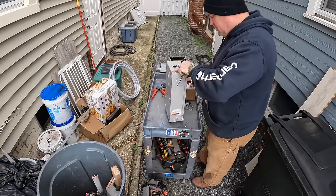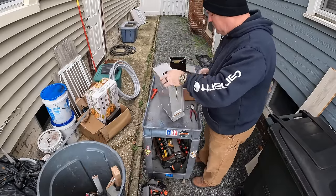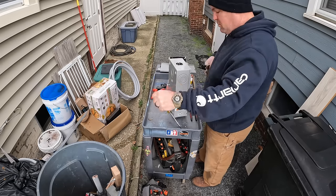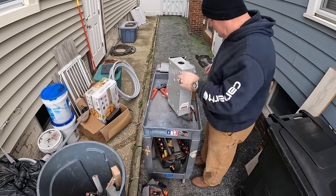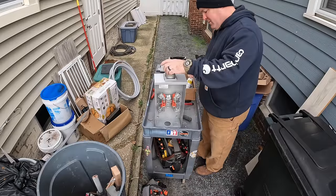As I went to put this meter on, I realized that I needed to take off the old connector from the existing installation. It was kind of difficult because the grounded neutral conductor was spliced together in such a way that it needed an inch and a half size connector, and I really should have done a 2-inch there, just to be on the safe side for ease of installation.